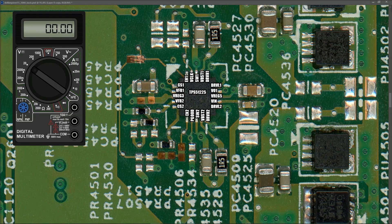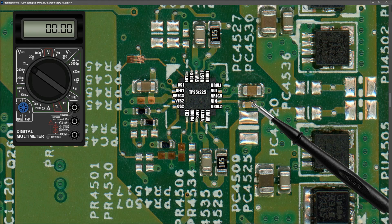With my multimeter in volts DC, I place my black probe to ground on the other side of the input capacitor and my red probe to VIN. It's easier to measure at the capacitor connected to VIN rather than the IC pins themselves. Measuring at this side of the capacitor, we get 19.5 volts — so the IC is getting the proper input. Next, placing my red probe to the capacitor on the VREG3 pin, I measure 3.3 volts — so we are getting our 3.3 volts always-on power.